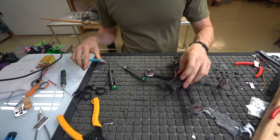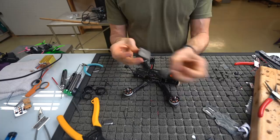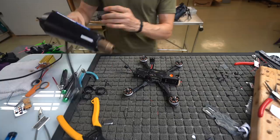Now, the one thing that people cry about and ask me all kinds of crazy awesome questions about: what the heck is this foam wedge? Foam wedge, peel it off. It's got adhesive on the bottom. It's a 30 degree mount. We'll go ahead and plug back in our heat gun, because this is the crucial thing about these little foam things. Anything that you're gonna stick on with adhesive, please heat it up first.